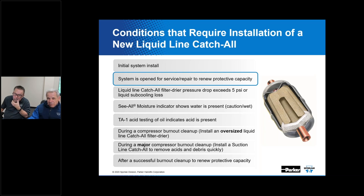And that's why, for the most part, they want to use brazeless fittings in the field on these systems. They don't want you taking a torch to them in any way, shape, or form. Yeah, I spent 14 years with LG Electronics, and that was their contention. That's not exactly all the reason why they have mechanical fittings, but you're right. They want mechanical fittings. In some places, they're kind of thwarted. Like in Chicago, for example, they won't have a mechanical fitting. Everything has to be brazed in the city of Chicago. So there'll be places like that.